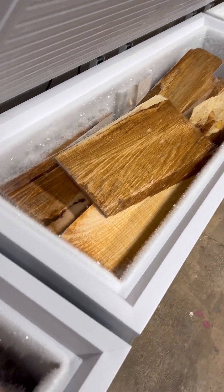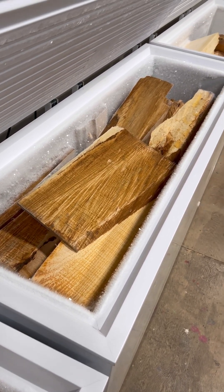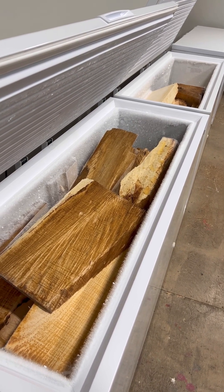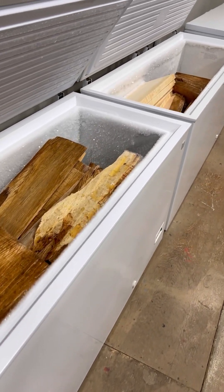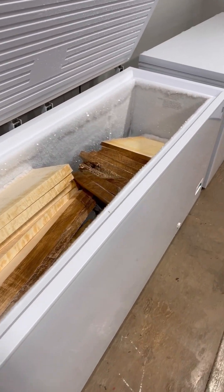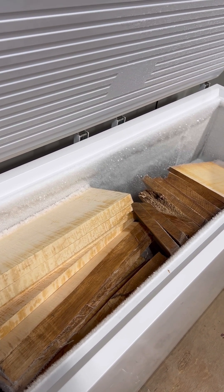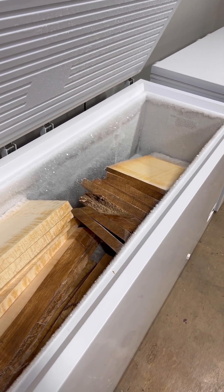With that much moisture, what's the other problem? Mold growth. A lot of the information you read online about mold growth pertains to homes or lumber that's been dried but has swelled. They say that just over 16% relative humidity in wood has the potential for mold growth. I would say 16 is not the end of the world — you get in the twenties, it can happen. I'm going to spare you all those details, but we're going to go more into this.